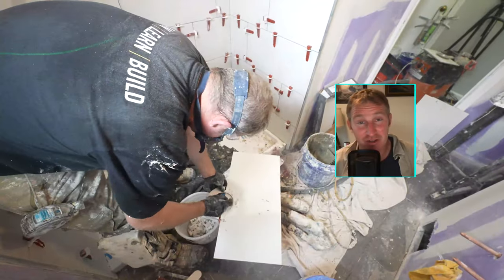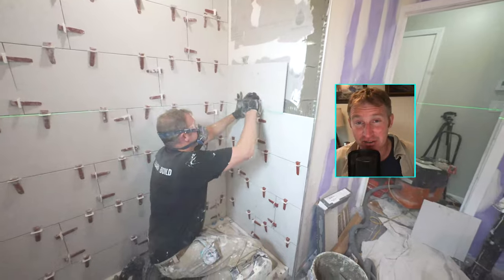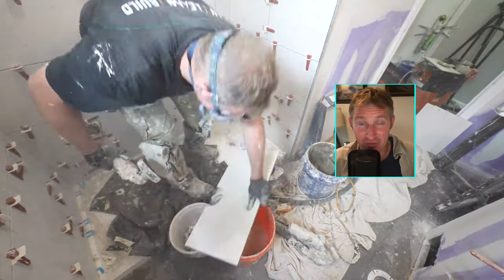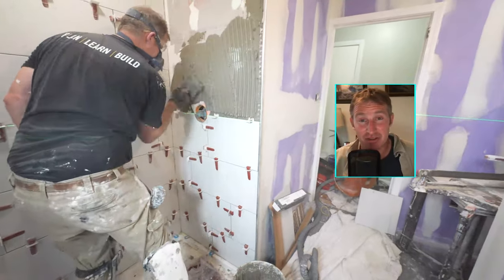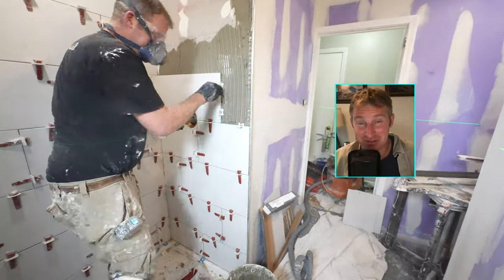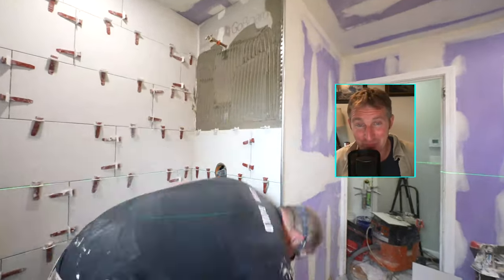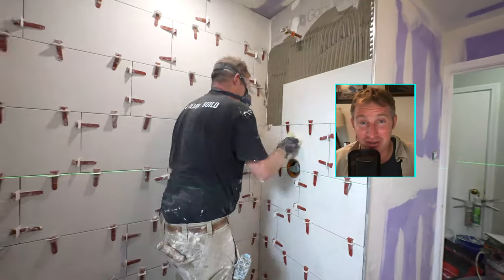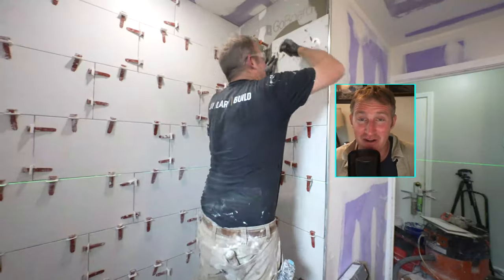As far as the valve trim, that's really just pretty much using a good grinder blade and making sure you cut as close around that little Schluter valve cover as possible. But be sure that you check your own shower valve trim. Make sure that you're covering those cuts. There's nothing worse than having an open cut there, because then you have to basically pull all that tile out and redo it. But it's better to know beforehand rather than once you get into the grouting stage.